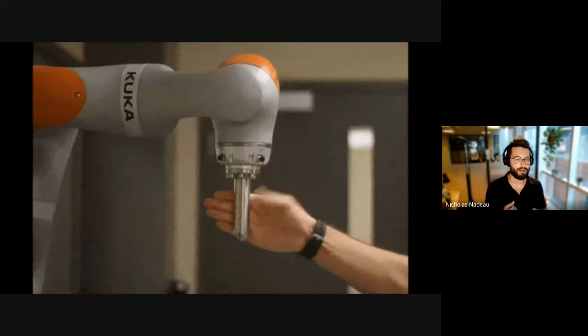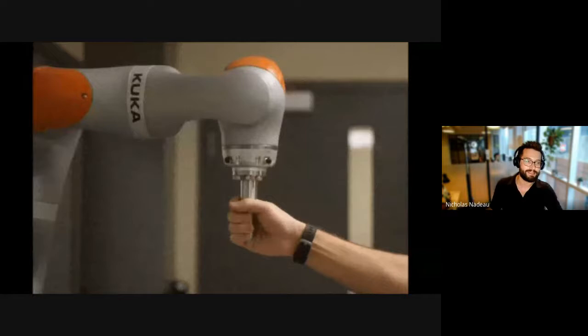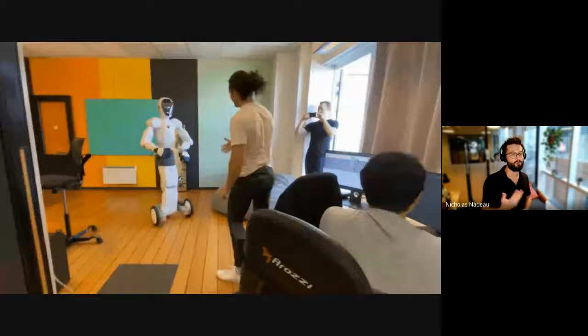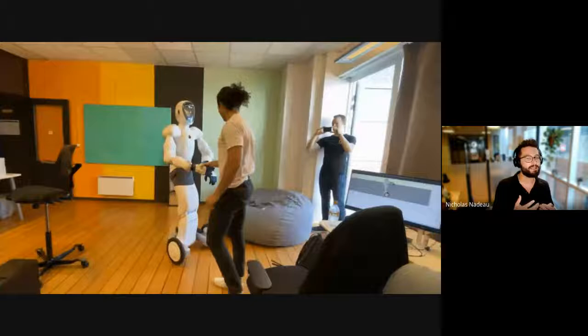And this natural has large implications on safety. Comparatively, we have our Revo motors, which are the highest torque to weight ratio direct drive motors on the market right now. And so we can have basically natural force impedance control with our low reflected inertia and a very high bandwidth. And this makes interaction with the robot feel very natural, leading to a safer application.